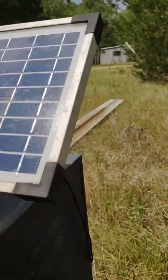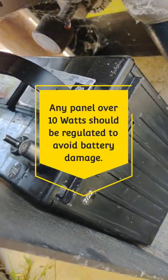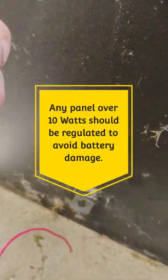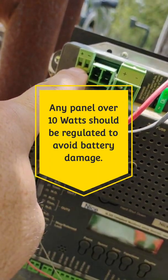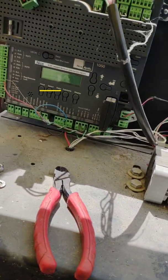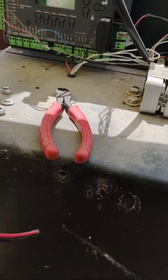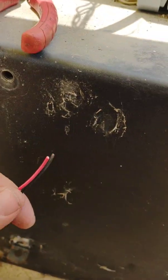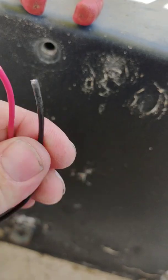Just a tech tip: you can't wire your 20-watt panels straight to the battery like they did — they'll damage the batteries. You want to bring them in to the solar panel connection on the 1050 board, or wire it into its own separate regulator and then go to the battery. A 20-watt panel can't be pumping directly into a battery; it will damage the batteries — basically boiling them out.